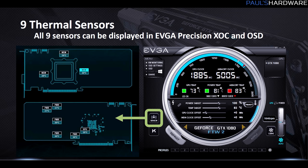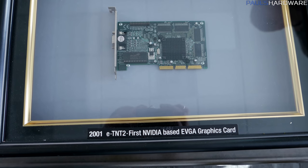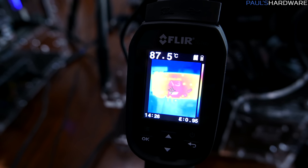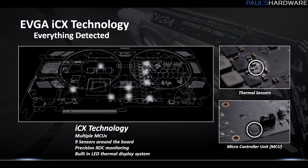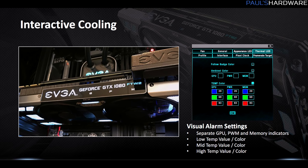The new PCB design allows these sensors to be placed in close proximity to those heat-generating components. Especially looking at NVIDIA GPUs over the past few years, they've gotten very efficient, and in fact the GPU is not always the hottest part of the graphics card anymore — VRMs and memory can overheat as well. They monitor these temperatures via MCUs, or micro control units, scattered across the board. These are programmable and can do lots of different things, currently being used for temperature control and reactive lighting, but could potentially be programmed to do other things as well.